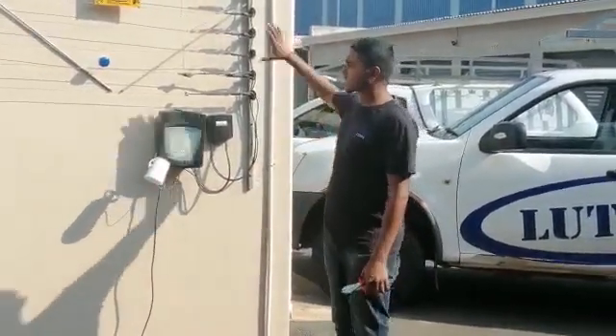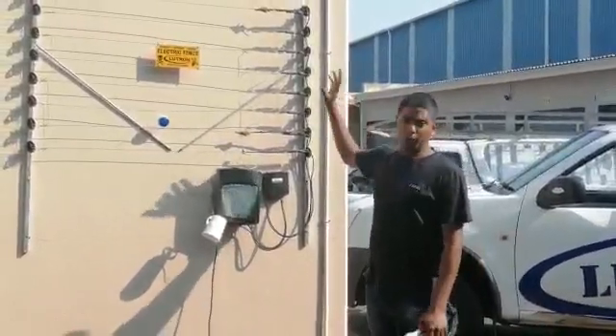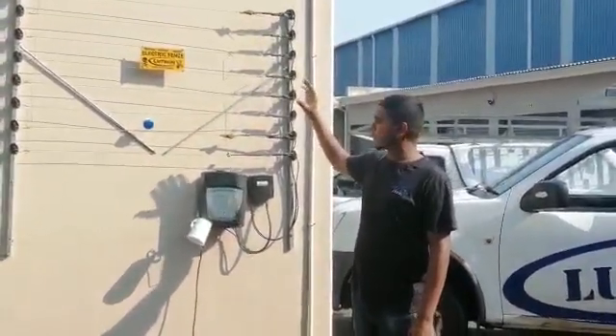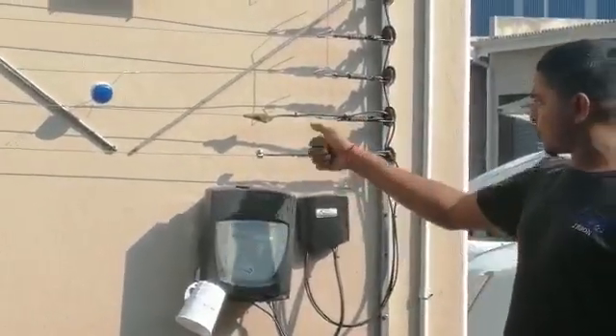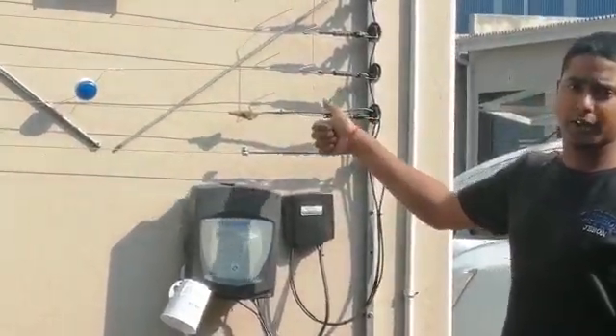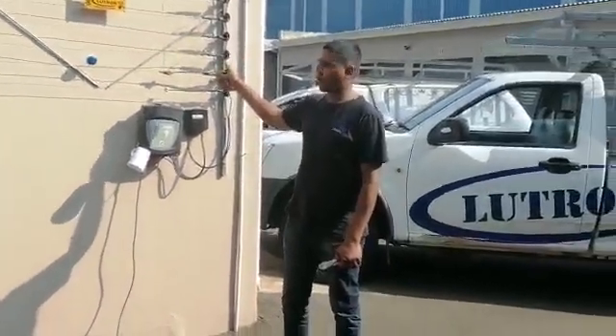In terms of your electric fence itself, if your property is on the coast you need to have things like Denso tape, line clamps or silicone tape, and proper stainless steel ferrules or tin-coated ferrules — it obviously depends on your area and how far you are from the sea.